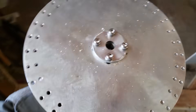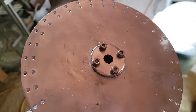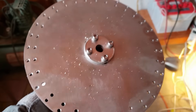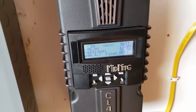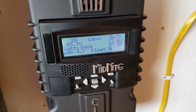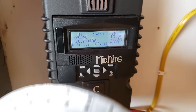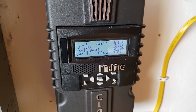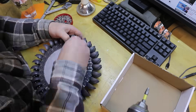I imagine this will have higher efficiency because it's a larger diameter. I'll be running at a lower RPM, and because the larger diameter should be more efficient from a water velocity interaction standpoint. Right now I have it running full bore on my two brass nozzles, and we're getting a little over 400 watts on average. We're going to see if this is going to get us more efficiency out of the same two nozzles.